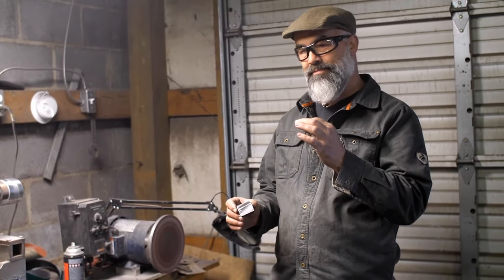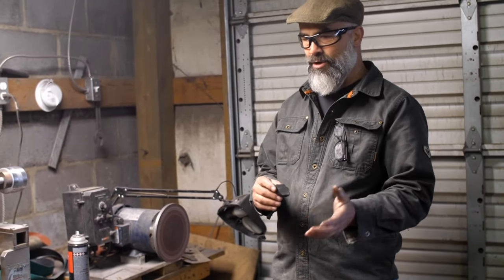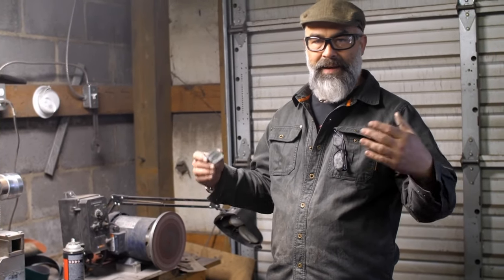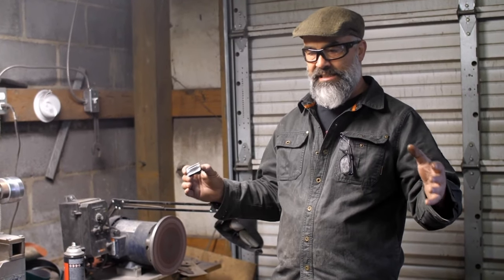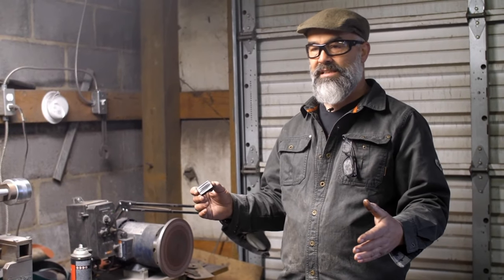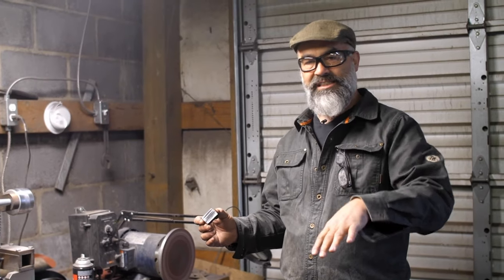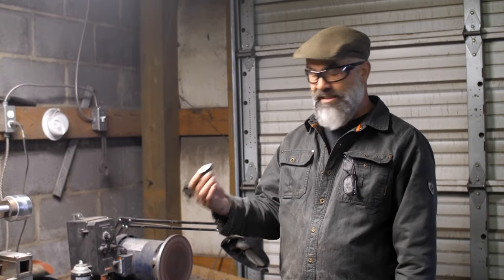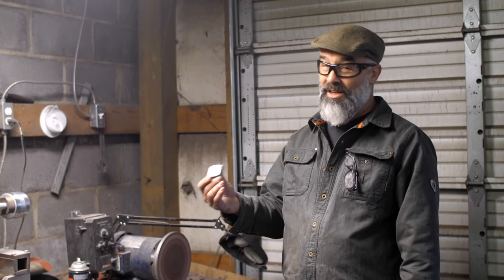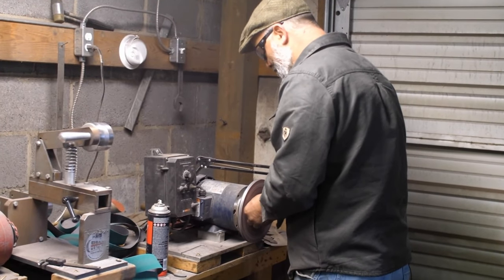for this because I'm pretty sure it would knock the teeth off of it because this is hard steel and the cold cut saw is really made for cutting tubing and pipe and angle and stuff like that, clean steel that you'd be using in a construction or fabrication setting where most of that is aluminum or not hardened steel, not steel that's already been hardened. This steel's been in the forge, so it's a little difficult to work, and that's why I use that. And it's maybe slightly annealed. Hope that answers your question.